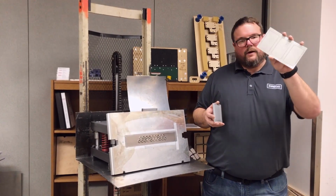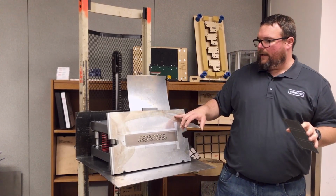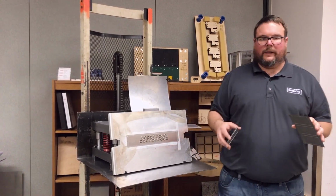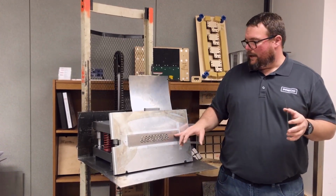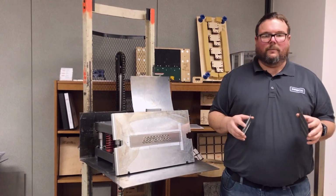But you might say, well, how do I mount that into my Preco flatbed? Well, the answer is right here. You have a flat aluminum plate, and the dies just simply get taped to the plate. Now, if you're just doing common cuts with no registration, this is a very fast changeover. Again, 5-second tool change out, no big deal.